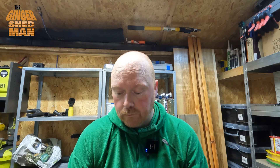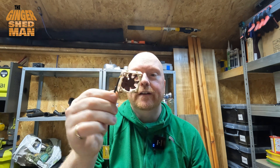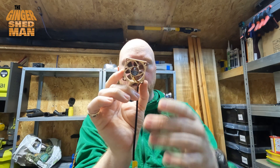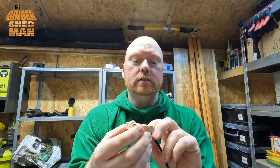The 5-volt fan is only little and we're going to be installing it in an adaptable box that's in the loft that houses a Shelly 1PM Relay that has the bathroom lights attached to it. So you can control it via the switch normally on the wall outside the bathroom, and also via your phone, web browser, all things like that.